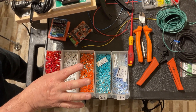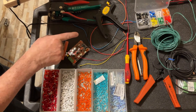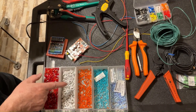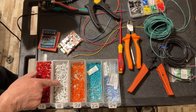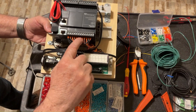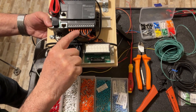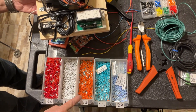The color is not to match the color of the wire, because the wires can have very different colors. But imagine for gauge 18 — you may have all the colors you want and you're still going to use the same kind of ferrule. The example is right here where I use gauge 20 wire, and all the plastic jackets are exactly like these ones in the box for gauge 20.